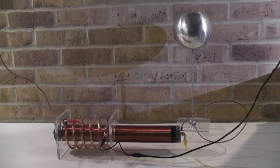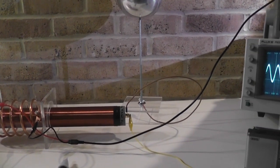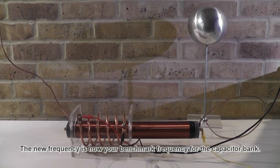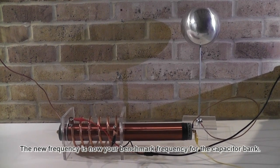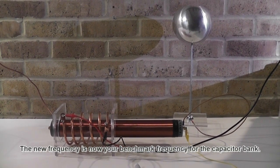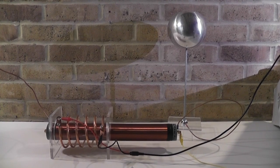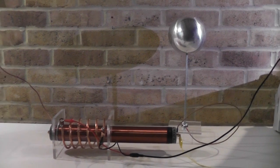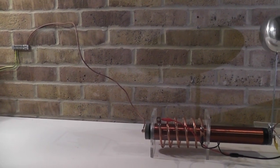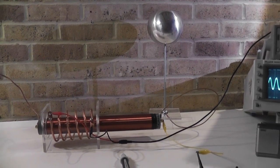That is now our current setup — it's a standard configuration. We have a Tesla coil, we have a primary, we have a secondary, we have an earth connection to the back, and we have a top load on the front. That's a traditional setup. With this, bear in mind, we have now 532 KHz. If you consider transmitting via a specific frequency to the ground, do your measurements before — you have to at least double the frequency on the secondary to be in the range of it. It becomes quite tricky, as there may be no calculation giving you the value of how much frequency is reduced when you connect to ground, since that's a direct connection with no coupling capacitor. This can probably change from area to area based on your ground connection.